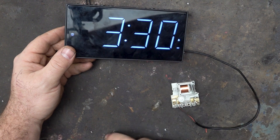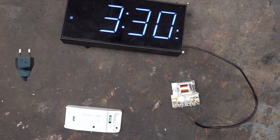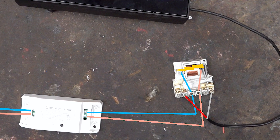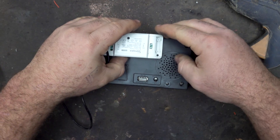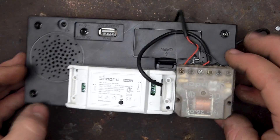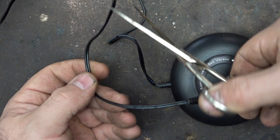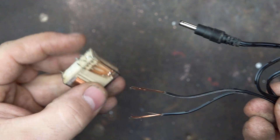Let's see schematically how to connect all the parts. We have the alarm clock, the relay, the smart Wi-Fi switch, and the 220-volt input. The input goes into the Wi-Fi switch, cables go to the alarm clock, and every time we give an input to Wi-Fi, electricity flows to the coil and closes the contacts, making the alarm clock stop sounding. I can glue the connections behind the alarm clock for a more compact build. Now for the car horn: the bed shaker was connected to the alarm clock with a little plug — I can cut the cable and use the power flowing through it to activate a relay.